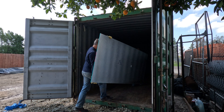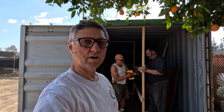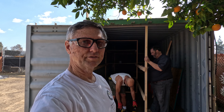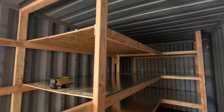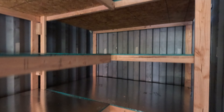These are the frames that will hold the shelves — four by eight sheets — so we're going to build six of these frames first. Once we completed the six frames, all we had to do was rip the plywood so that it would fit properly for length. The width was already set at the four feet between the two-by-fours, so we got out our skill saw and cut these panels to the right length.